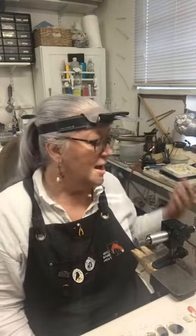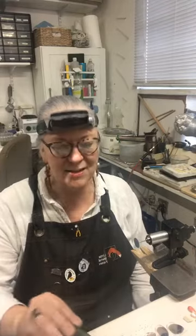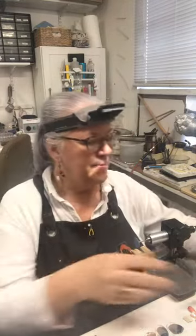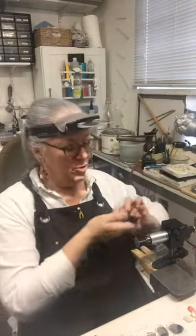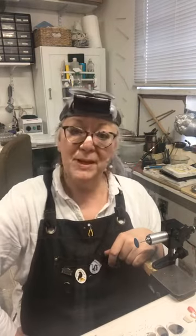Look around the garage and look around your hardware store. Usually you'll find a little selection of awls and punches and things, and hardware stores are fantastic for that. I really love doing garage sales and markets where you can find old tools, because this kind of stuff you can pay pennies for and get a really great old piece of steel and adapt it for your needs. Drifts and punches are great for that too. This punch has a nice cylindrical tip — great for doing things like a jump ring mandrel and for smaller punching. There are nail set punches that have a little divot in the end, and those are actually great for making little circle marks on things. So there are all kinds of cool scribes, awls, and tools out there for making dents, scratches, and holes.